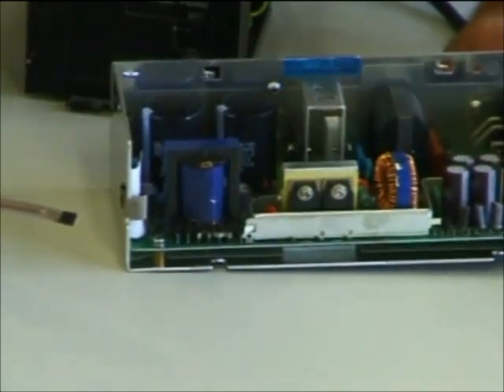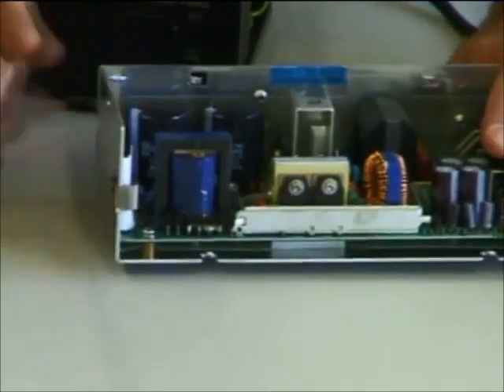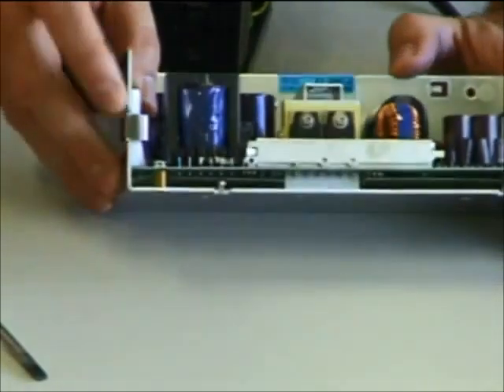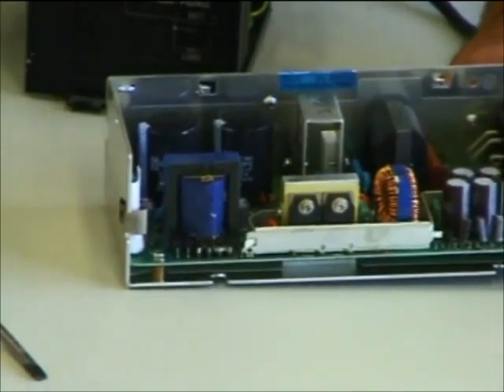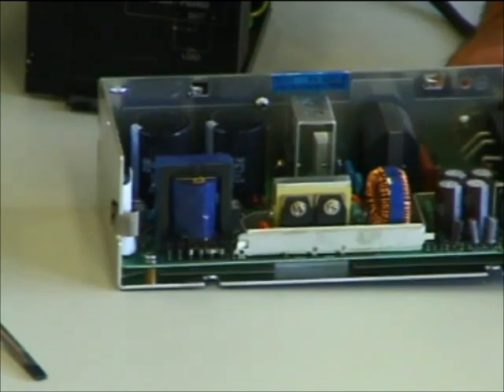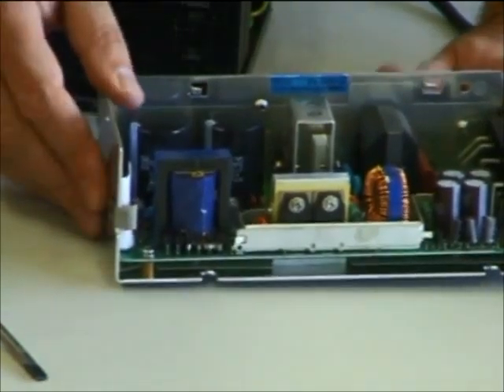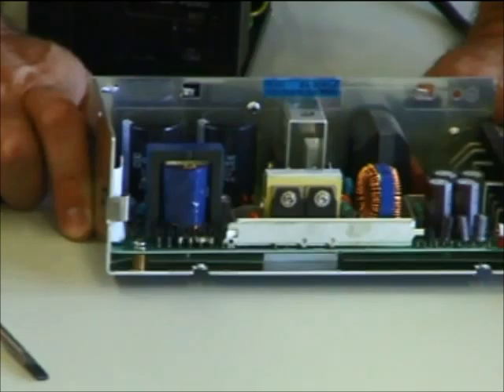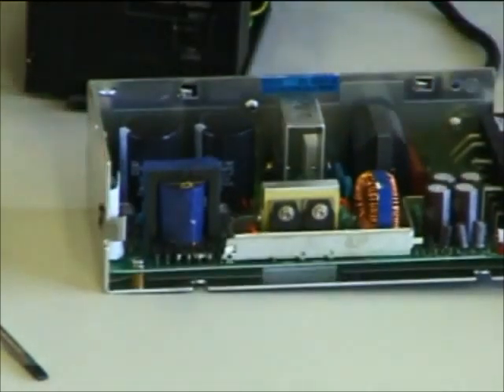This is a different type of transformer in a switch-mode power supply — not in the exam, but worth mentioning. This one is capable of carrying a similar power level to the larger transformer, yet it's so much smaller. It's running at a high frequency — probably about 15–20 kilohertz. At higher frequencies, power transformers can be made a lot smaller and more efficient. When running at only 50 hertz they've got to be quite big and husky, but in computer-type supplies they can be made smaller, more compact, and more efficient by running things at higher frequencies.